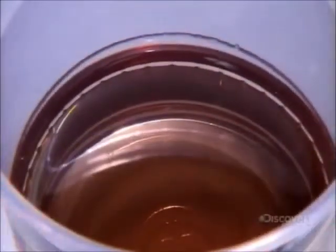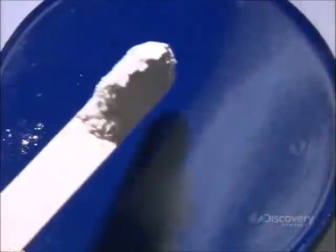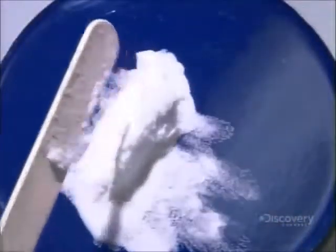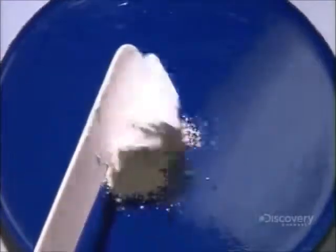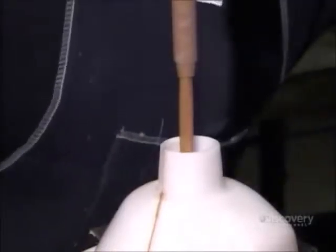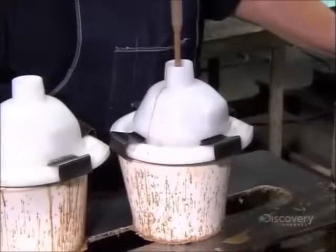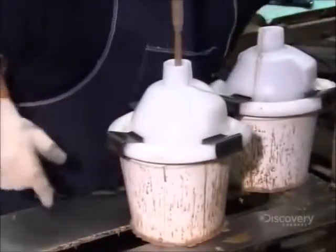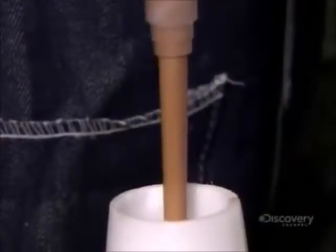They make the cores from polyester resin, blending in minerals like barites, silica powder, and limestone. The result looks like chocolate milk — or make that hot chocolate, because a catalyst triggers a chemical reaction that heats it up. As they pipe it into the molds, it quickly starts to cure and solidify.